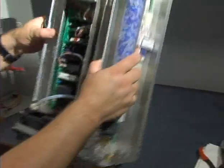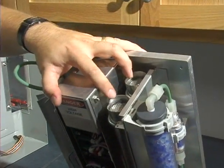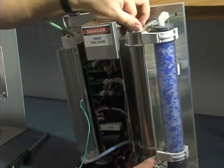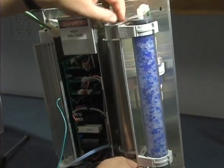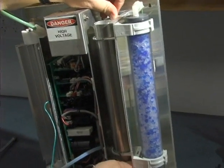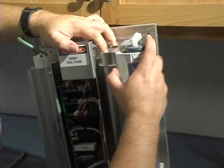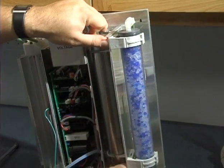To gain access to the media, it's from the top. We're going to remove these snap rings and the grate and pour out this media. First, pull these guys back, and then we're going to gain access to the air dryers — go ahead and pull them away with the springs and push it up from below.